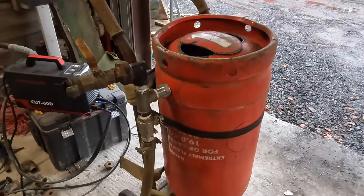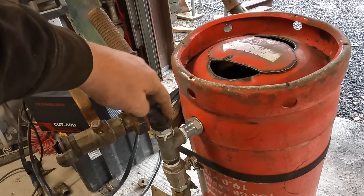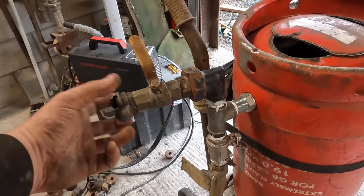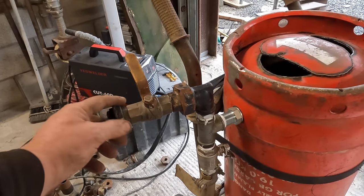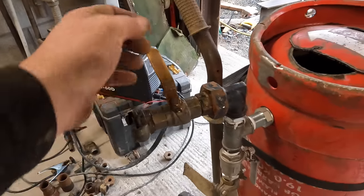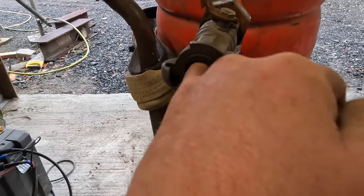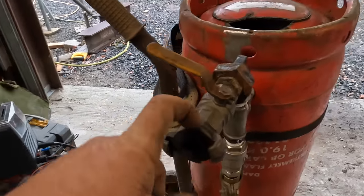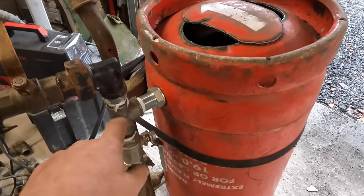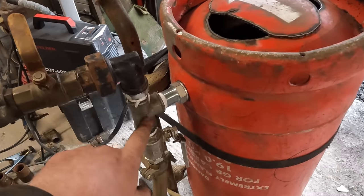Right, so plan now, this is just here for a mock-up. I found an elbow that's not got chite in the middle of it. So this is just as a mock-up. So you're going to put your air in, so you can either have your claw fit in, your 3/4 claw, which is good for 250-260 CFM through here. That's a high flow claw, the bigger bore. Some claws have got a tighter, reduced flow in them, so just be careful on that. If you can feel that it's a big one, it'll do it. So it's the same bore all the way through, 3/4. I think it's 19mm internal bore. So it's 19mm all the way through.